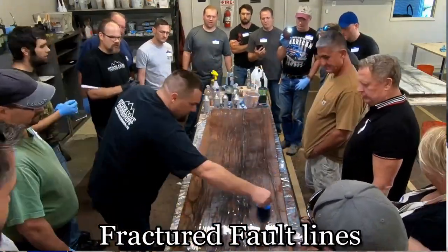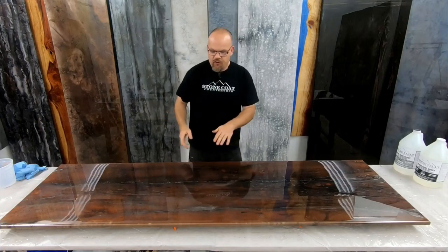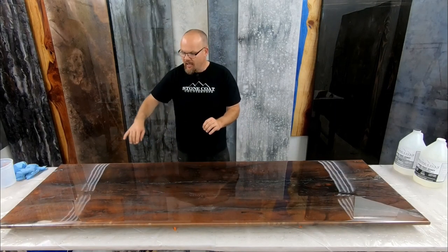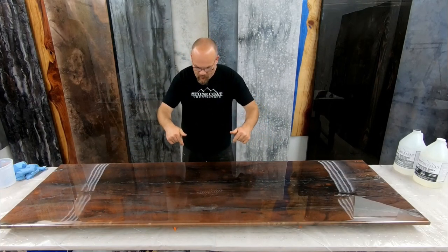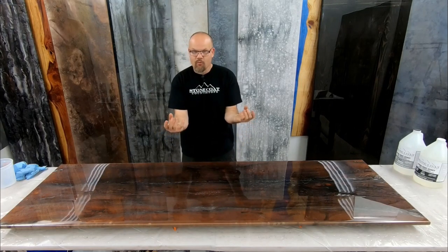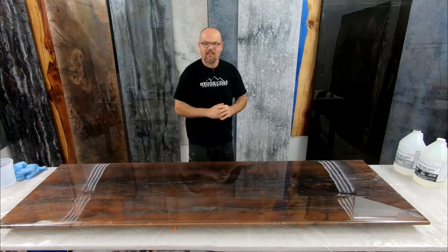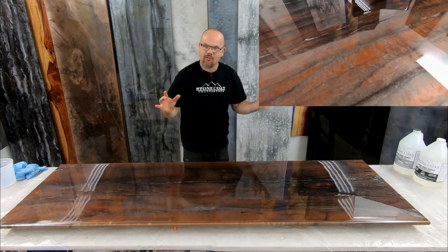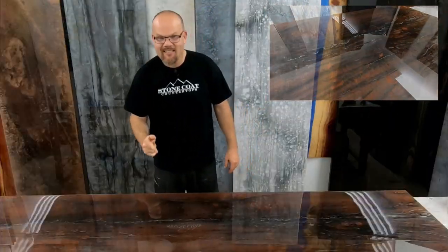That glove technique, just skipping that glove over a metallic base, that's key. If you go over metallics as your base and you use the light pressure of that latex glove, dragging it across, that's why we get some of these darker lines, and it grabs all of that paint, brings it into the metallic, and you get some very, very realistic effects that would take you countless hours to reproduce if you tried to faux paint this. This is an amazing technique.